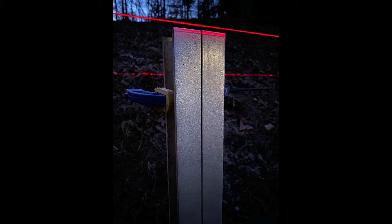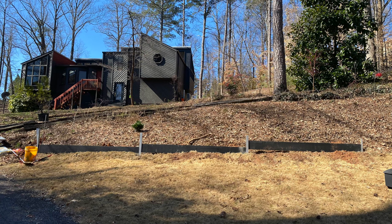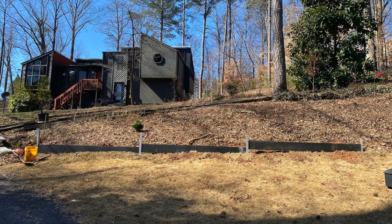We're working with a hill that slopes in two directions, not just one — it kind of slopes to the right too. Three dimensional. The C-channels aren't necessarily perfect and my holes aren't necessarily perfect, and they are at least 10 feet apart because we're working with two by tens. Then the next day we set up at least two of them, if not several, and this is showing the next day where we try to do more of this. You can see in the corner — those are not set yet for sure, they're just kind of sitting in there.